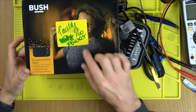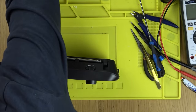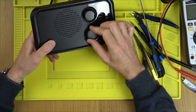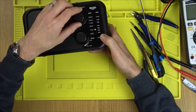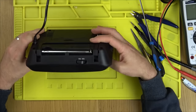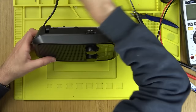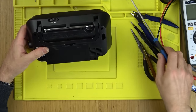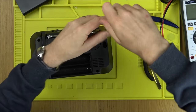Next up: a 40-something radio with no power. When I plug it in on AC it clicks but nothing comes on. The tuning dial also goes off-scale at the top and doesn't work its way to the bottom. No point trying batteries yet — there's definitely a power problem. These units are linear supply, which I think are pretty reliable, but something's gone wrong.